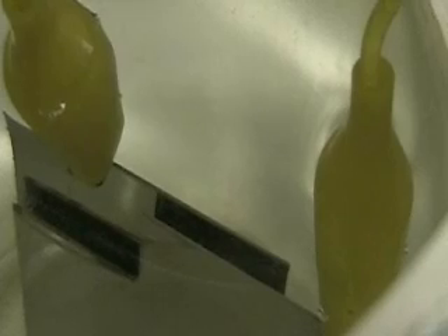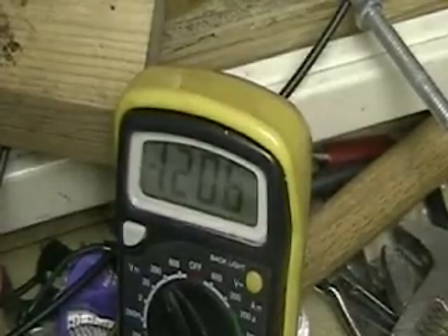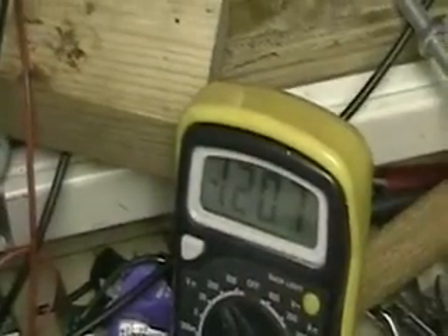Get a closer view here — we've got 110 volts. 111, 112, 113, 114, 116, 117, 118 — there's 120 volts plus seven, 120.7 volts. No action. That's the plates being spaced 1/16th of an inch apart. There's your voltage at 120 point something — it's fluctuating. And again, there's our line voltage.